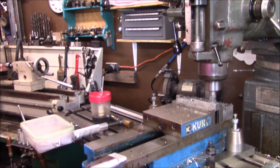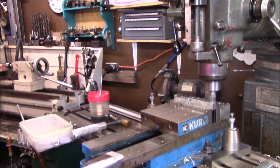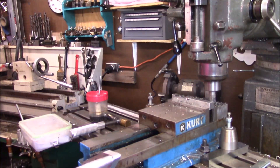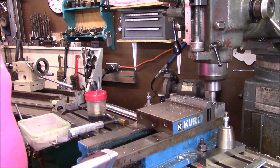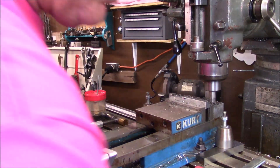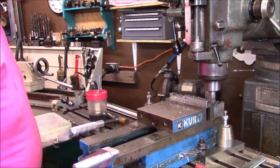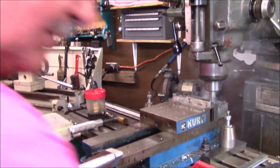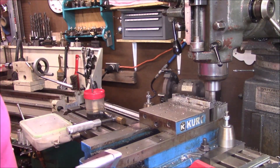The reason for that is so that work can be set across the top of it. I've established the zero on the part, and I'm just going to mill back and forth to start with 100-thousandths. I'm going to cut an inch off the first slot and just kind of cut it down. The mill isn't acting great today — I'll just back off a little bit.